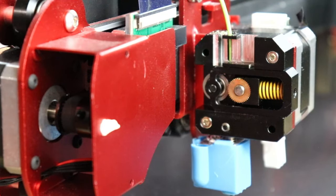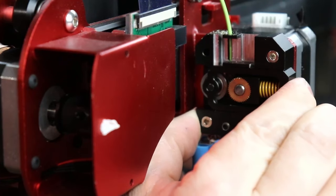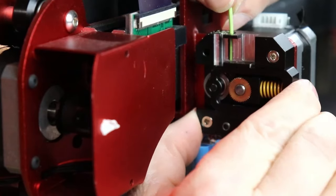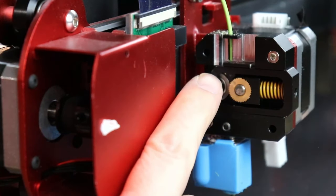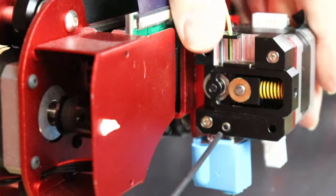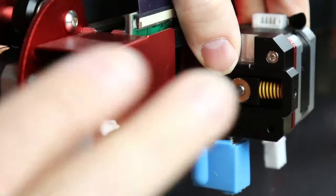So that's basically, you know, you got a decent printer with a decent print quality, and you have the cheapest extruder and hot end on the planet with iffy quality. And again, you're only pulling from one side. You have the idler on the left, you have the hob gear on the side, and that hob gear, for whatever reason, PLA will put a groove in it. So again, just low quality stuff.